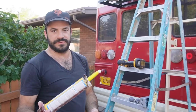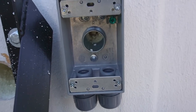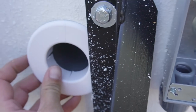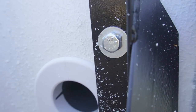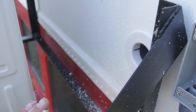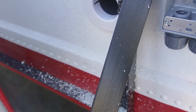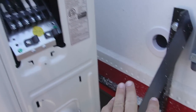In our case we're using Sikaflex — however you want to pronounce it. There is our electrical pass-through — that's the hole I just drilled. This piece here is going to go right over that, and that's where we run our refrigerant lines out of, going straight through to the inside. When you drill this, you want it sloped downward slightly so that any moisture that lands on the lines doesn't run down into the living space. My next step is to get this glued in and sealed up, and then we'll get started planning out our refrigerant line runs and getting our electrical components tied in.